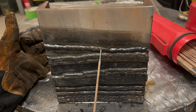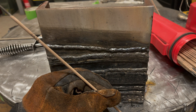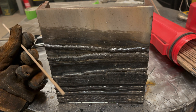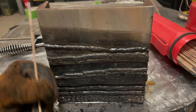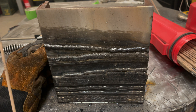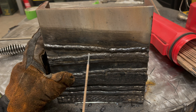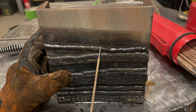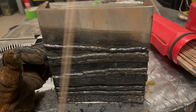You can see it's possible to weld in the horizontal position without any dripping issues if your amperage is correct. I'm using 6013 3/32" rods at 80 amps — a little bit on the cold side. I prefer running 1/8" rods for 6013. These 3/32" rods don't deposit very much metal, so you have to go kind of slow to get the deposition rate you want. I'm going to fill this in with multiple passes using the 3/32" rods and then switch to 1/8".